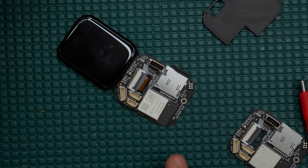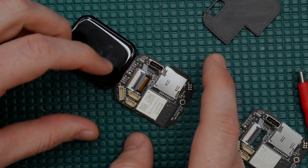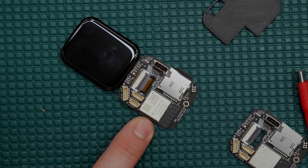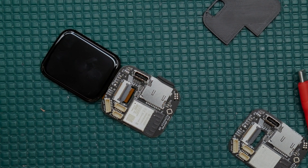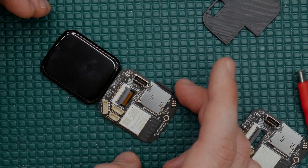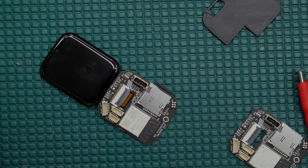If I give you just a tour around the board: obviously we just talked about the USB-C, which is for power and data. It's USB-C strapped for five-volt loading, so it actually provides five volts to the board. We have a micro SD card slot. We've got tag connect here, which if you're familiar with that, you can use to program or debug the board. This is an ESP32-S3 mini — really cool, super tiny little module. And of course, this is a Wi-Fi/Bluetooth combo module, and the S3 is very powerful so you can do a lot of cool stuff with it. This is the flat flex connector down to the display. We've got a tiny little LDO on the board — the linear regulator which provides 3.3V system power to the entire board — as well as backlight control. So if you want to change the brightness of the backlight or auto-dim it, you can do that with a PWM pin out from the ESP32.